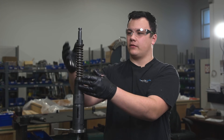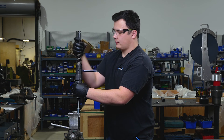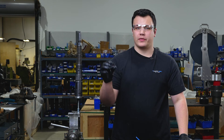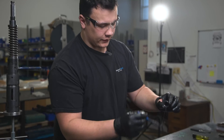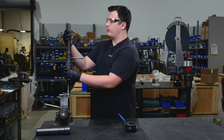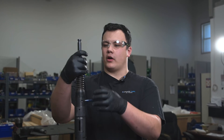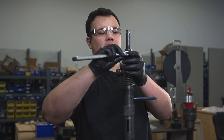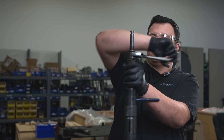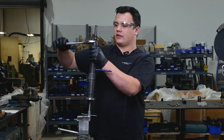We'll then compress the spring and begin to tighten. We'll repeat the same process with our spring retainer washer — a small amount of grease on the inside of your threads, place on top of your core and thread down. Now that we have our lock nut retainer and spring nut retainer in place, we're going to take our adjustable crescent wrench, tighten up against our tool, and with the assistance of a wrench we'll tighten these completely down against our core.